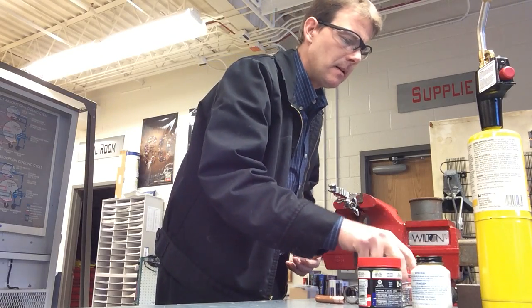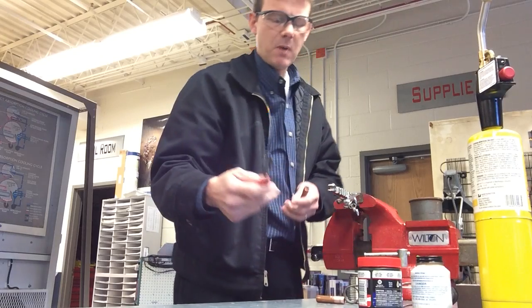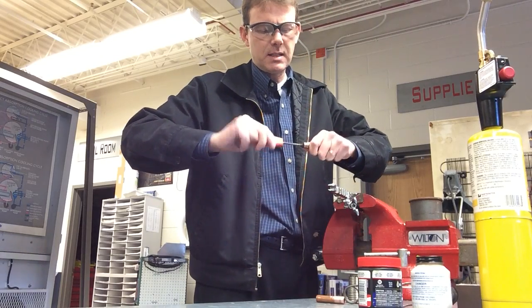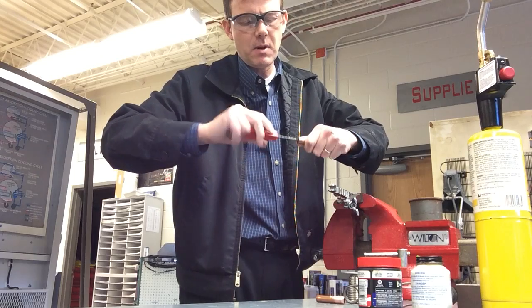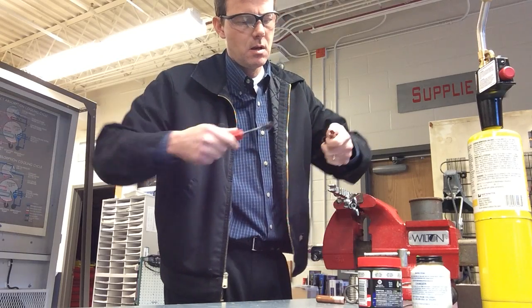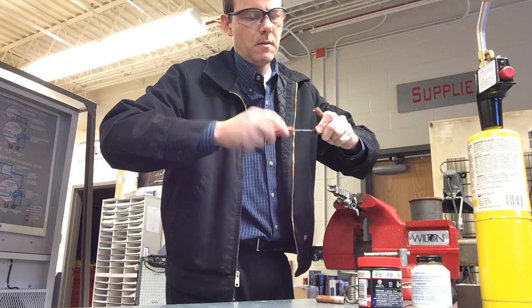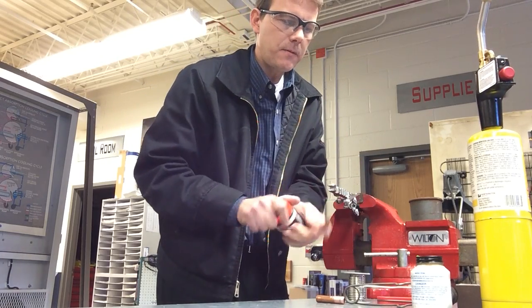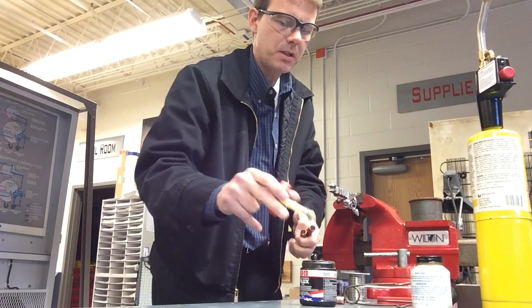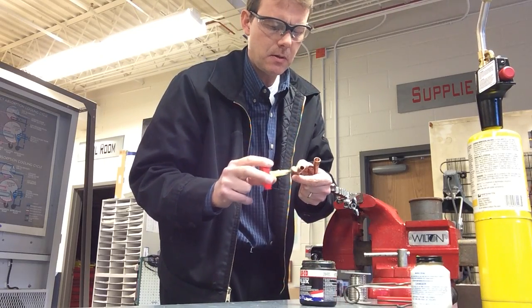I don't want to touch it after cleaning — the oil from your skin will keep the solder from sticking and could allow for a leak. I have the swages and a brush that's the correct diameter, like this half-inch tubing brush. I can clean the inside of the swages with the brush, and then I'm going to go ahead and apply the LACO flux. This one comes with a brush in the can — you can also follow the link below if you'd like to purchase it.